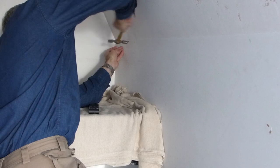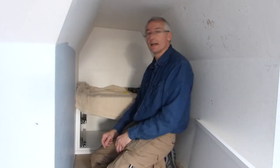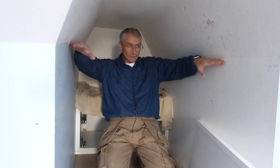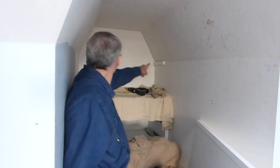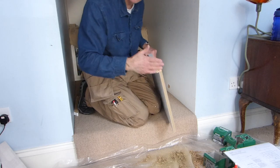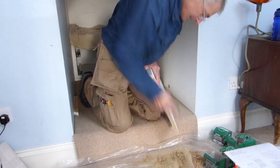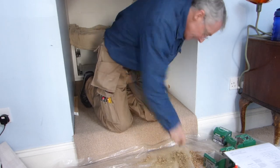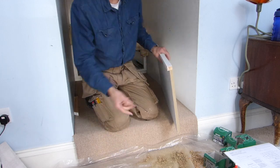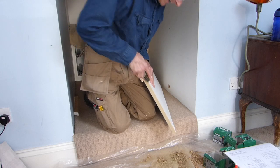Our last job is to fit a small shelf across the width of the opening, starting with the right-hand side bracket fixed in place in the usual way. One of the things that has caught me out a little bit: I'm putting a shelf in back here and the height of this waistline at the front is not bad, but if you look all the way through to the back it's way lower on the left-hand side than on the right. To get the shelf to the height I need, I'm actually having to bevel the whole of one edge of the shelf all the way across. Doing this on site is a bit of a pain — it's the sort of thing that would be much easier to do back in the workshop. And before all you track saw fans say you could use a track saw for that — well, I can't, because a track saw would cut that way and there are lips in the way. Old school is the only way forward.